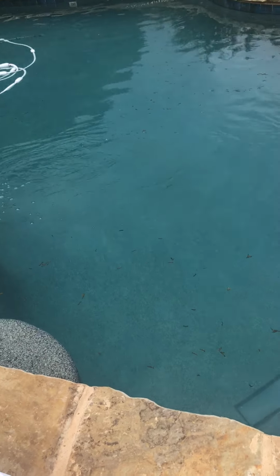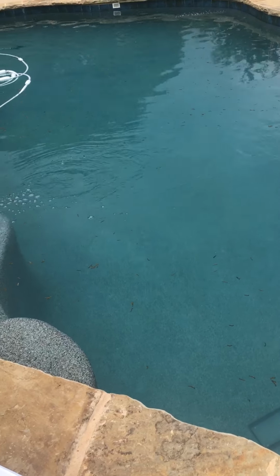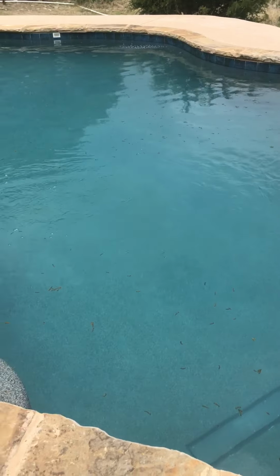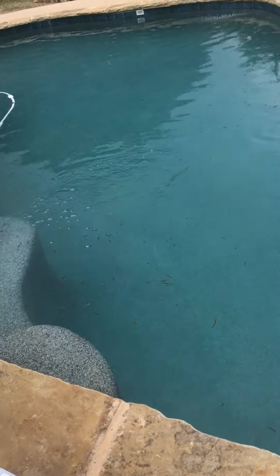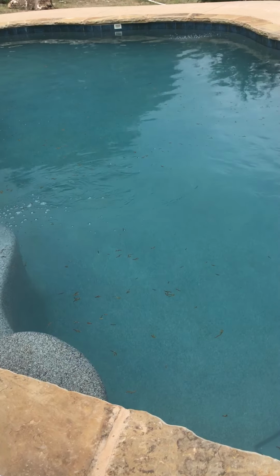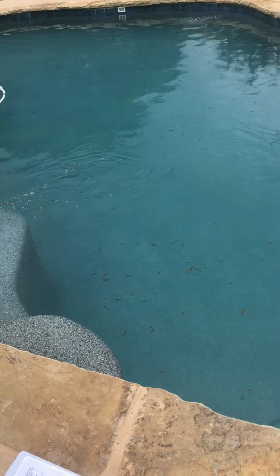So, on the tail, it's not wagging right now. It's kind of turned off. There's a stainless steel screw on it. If you like it wagging, it helps to sweep behind it. We don't want it coming up past the side of it. Right. But it can do a small momentum like that. I can open up that screw a little bit and make it turn a little bit. Most people don't want it spraying out of the pool a whole lot and wasting the water. Maybe adjust it a little bit.